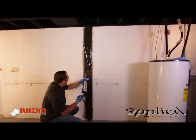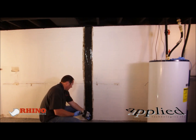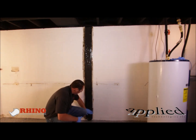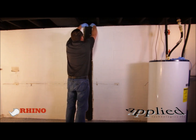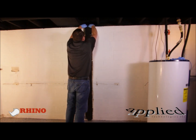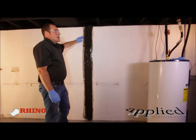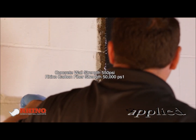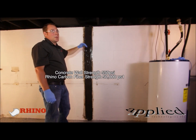Make sure you've got nice good coverage with plenty of epoxy on it. Notice I'm only getting one hand in the epoxy so I can use the other hand on the gun. Epoxy is clear, so if you get it on anything it won't make a mark, but it will definitely harden. We've just about completely completed our carbon fiber repair. The wall is now stronger than if you had a steel beam against it — when a concrete wall first breaks, it breaks at 550 PSI, and this takes it to over 50,000 PSI to break. At that point, it would literally rip the wall in half.